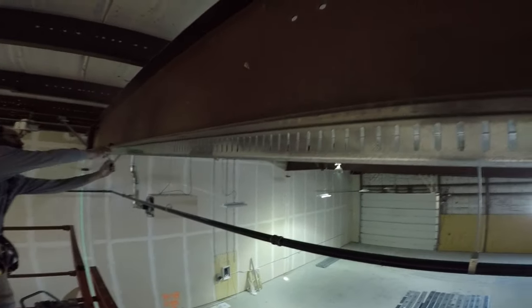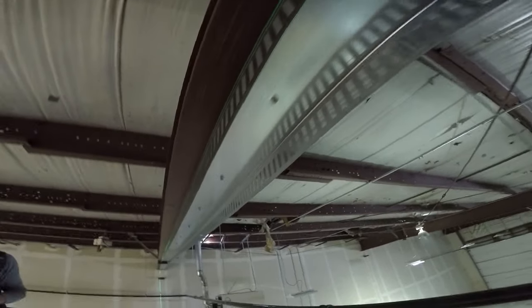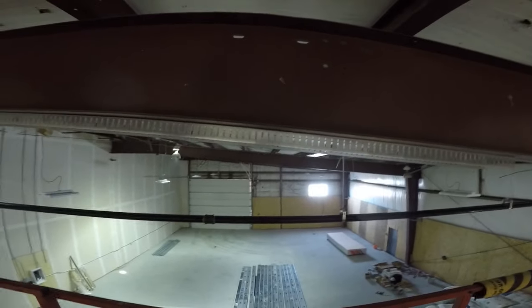When you're going to shoot your track in, clamp it on — easier when you work with a partner. Clamp it on, shave the beam, get it on your mark. Two pins on the end. I go about every foot on this track with pins in the middle, two on the ends. Don't draw out your top centers yet because it's an angled wall — you're going to have to do your layout on the bottom and laser up.